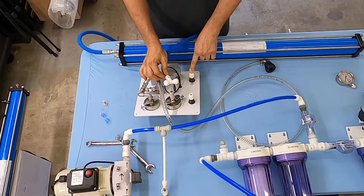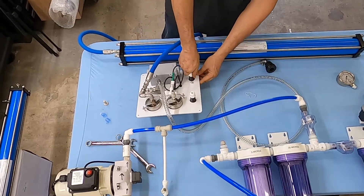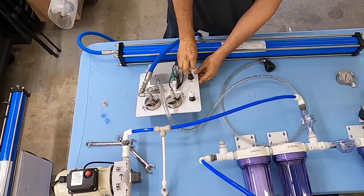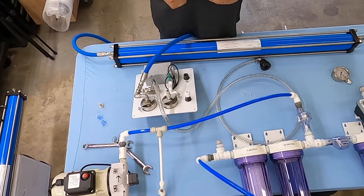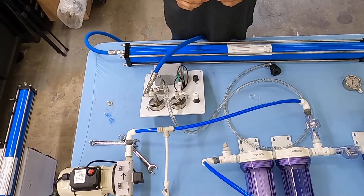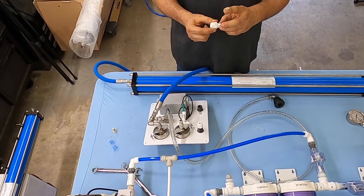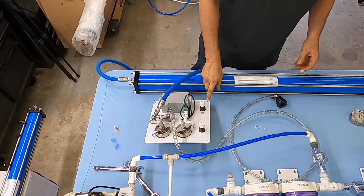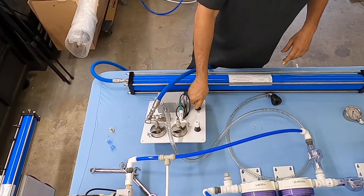From after the analyzer, we connect this to our fresh water tank with a 3/8 connector. If you don't like using standard-sized pipes, these connectors come out easily and you can replace them. Go to your local hardware store and find a 1/4-inch pipe thread to any size you want — these are very common. There are tons of connectors with a 1/4-inch thread that you can change to any size hose you want: a barb fitting, a push-to-connect — there are just so many choices out there.